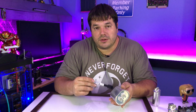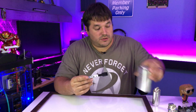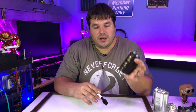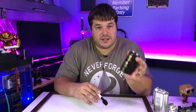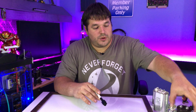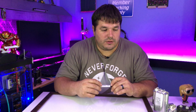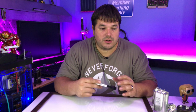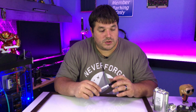Capacitors, not only do they act like storage devices in some circuits. For example, this capacitor actually came out of a variable frequency drive, and it was used to balance the DC voltage on that drive. So the way it works is kind of like a pressure tank in a plumbing system. And if you don't know what a plumbing system is, then you're not going to know what a pressure tank is either. There's also things in transmissions, so if you're a mechanic and understand hydraulic transmissions, then you can also understand these act as an accumulator.